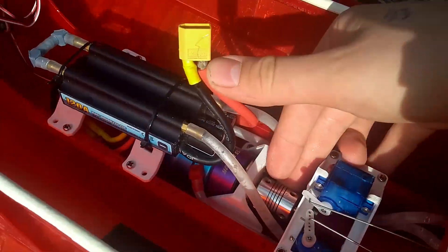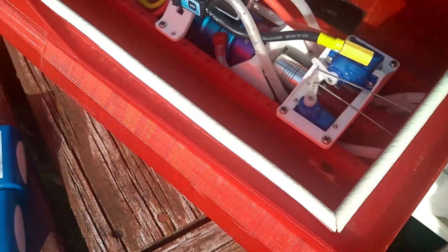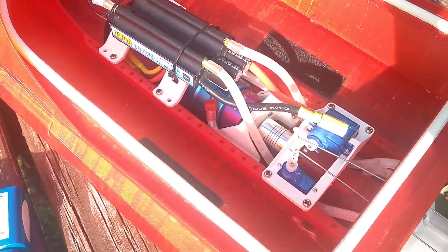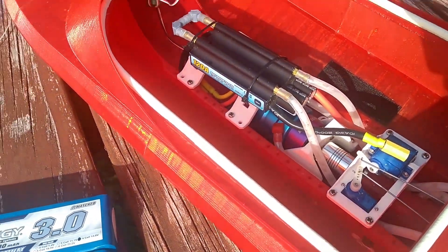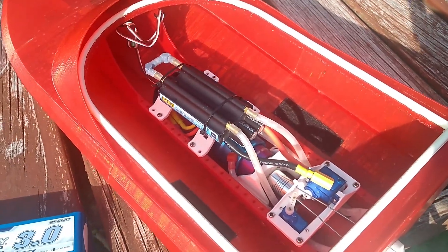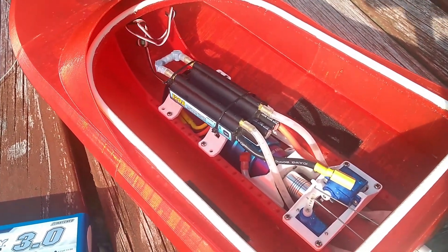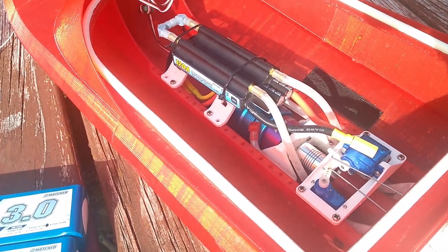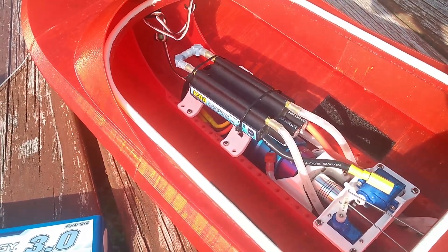I'm testing out this flexible coupler — I find it makes less noise than the universal joint. I realise it probably over-constrains the drive line, because you've got two bearings here and two bearings at the back, so there's probably quite a lot of force going through those bearings. The bearings in this motor have been way too wet way too often during all my testing and development phases, so I wouldn't be surprised if the tolerances on them are quite high — I'm going to have to replace those anyway.